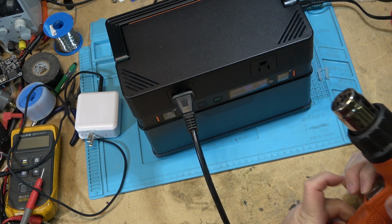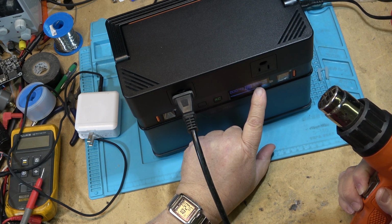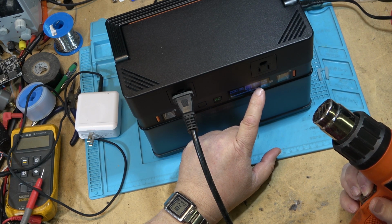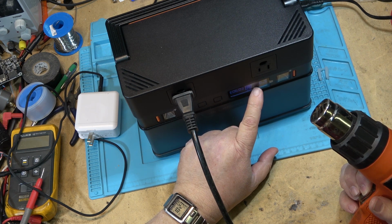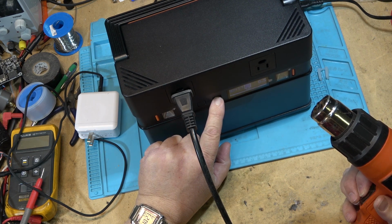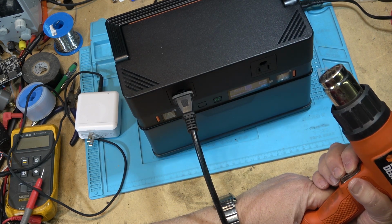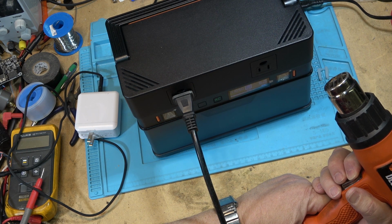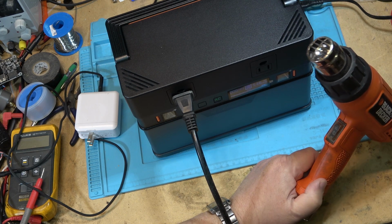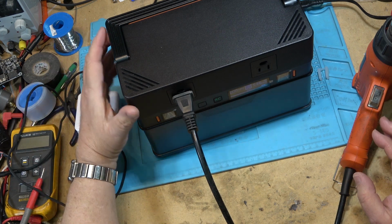But if I turn on to low power, showing me we're drawing 545 watts. Now if I turn on the high power, I should max this out. Oh, so I overloaded it because I don't have this thing set for surge. Although it will let it start. So that's the shutdown. I can start something for an appliance that takes power to get going, but then it has to go back. We're going to start the stopwatch here. I'm going to draw this at this type of power, and we'll see how long it runs before it shuts down.